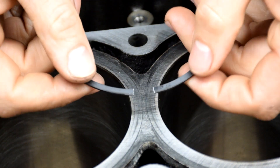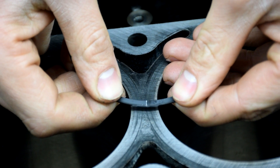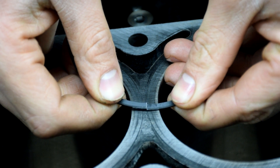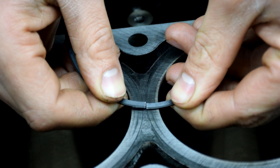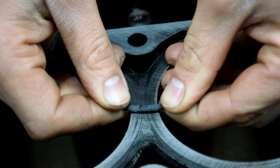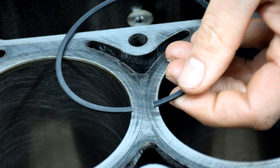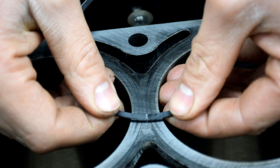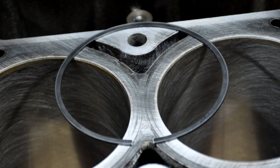Another tip: once in a while after you get done grinding, hold it up to the light and push the gap together to check if they're square. You might have a pie-looking shape, and if you have a pie-looking shape, that's not good. You have to reassess how you're grinding it — square it up, and hopefully you didn't take too much. If you did, you might be in my predicament. Go slow; make sure you don't get that pie shape and keep them square.